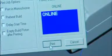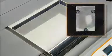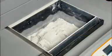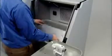When ready, click Print and watch your 3D model emerge from the bottom up, one cross section at a time, in 600 by 540 DPI resolution. When printing is complete, a vacuum and motion system automatically removes up to 80% of loose powder and recycles it for future use. Removing the remaining powder is just as easy, using lightly compressed air in an enclosed chamber that vacuums away particles as you go. Every 3D model emerges clean and ready for finishing. The ZPrinter 650 comes with a convenient built-in finishing station for an integrated, all-in-one 3D printing system.